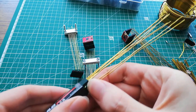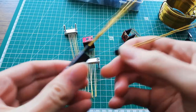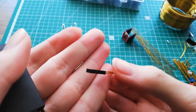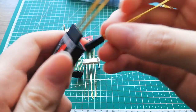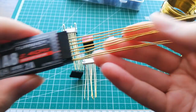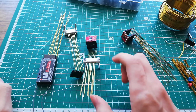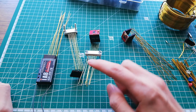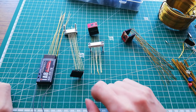And again, this is as simple as having these plugged on. Maybe I can actually detach it. Yeah, it's just two wires stuck in here, and it's really just a DuPont connector. And honestly, I wouldn't want to fiddle around with soldering these brass wires onto the controllers. Because like I said, soldering anything with these brass wires is a pain. They just heat up, the entire heat just dissipates into them, and the solder just doesn't want to work.